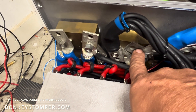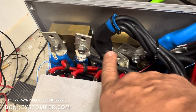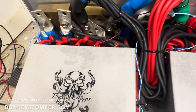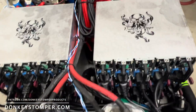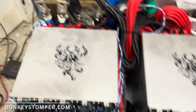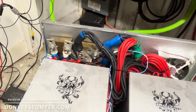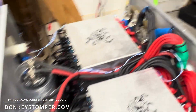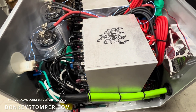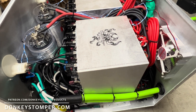These are two 1500 amp shunts, which is a little bit lower than what the power supplies are rated at, but it'll be all right — that's the biggest shunts I could get, so they're 1500 amps each. The power supplies are actually around 2250 amps each. Say 120 amps times 40 of them — that's 4800 amps. There will be loss because of the wiring and stacking, so I'm going to call it 4500 amps. There's no doubt in my mind this supply will run 4500 amps; I just don't know if my electricity can handle that.